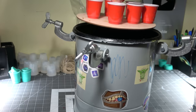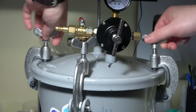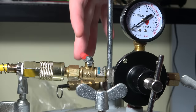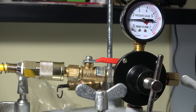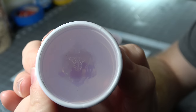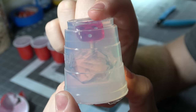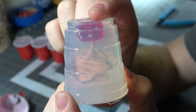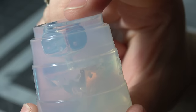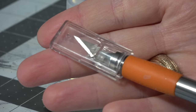So now that you understand what a pressure pot is and how it works, let's resume. We're going to lock the lid to the pressure pot super tight because any air coming out is no good. Once we connect the air compressor, open the ball valve and watch the pressure go all the way up until it hits around 40 psi, then close the ball valve and disconnect the hose. I let it sit for 12 hours — all that Sorta Clear 12 needs to be completely cured — and now we can take the molds out. You can see the molds did a great job. Once I pull them out of each of the cups they are good to go.